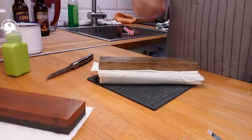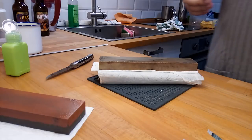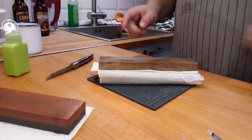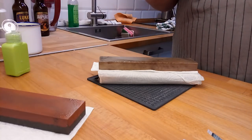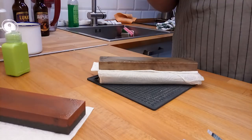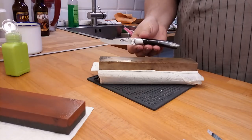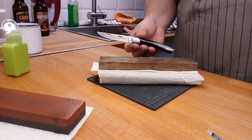So, you saw Norton India Fine and Washita stone. Of course, very important was the work with the round file to create a choil, which will make future sharpenings much easier and much more pleasant. Again, a French traditional knife in nice quality stainless steel